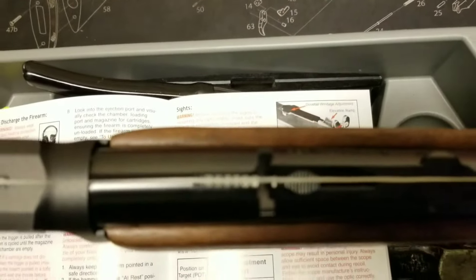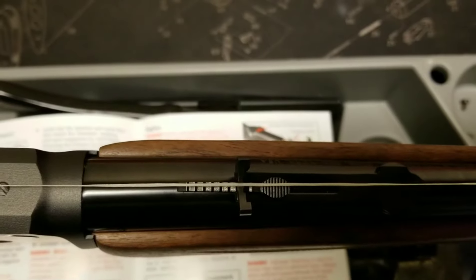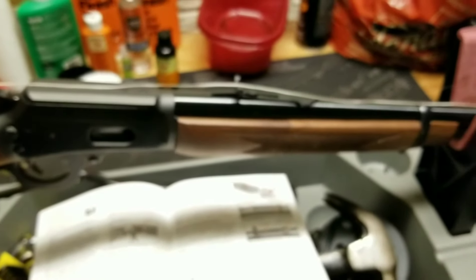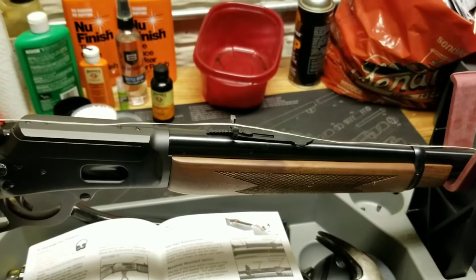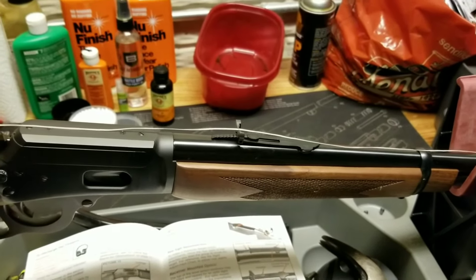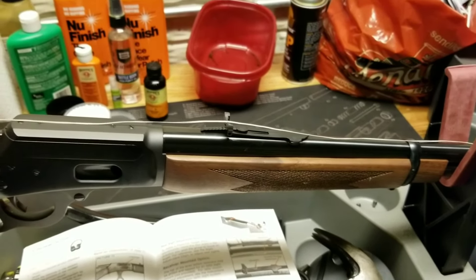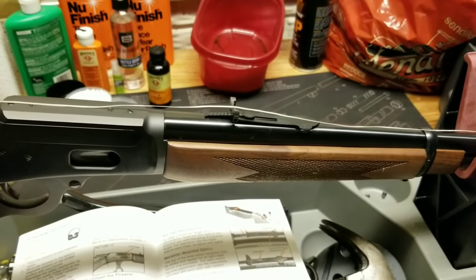We set the floss up so it's centered right across our gun, and look at that — it is now dead center of our buckhorn, right in the center. Do I think this is going to fix my shooting-right problems? Yeah it should help, but I don't know if it'll make it perfect. At least I know how much I adjusted my sight because I took a measurement before and after. If I need to make more adjustments, I'll know exactly what to do. Hope this little trick helps you guys. Take care.